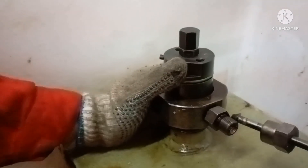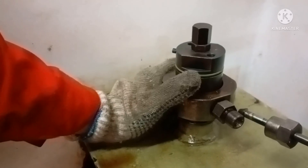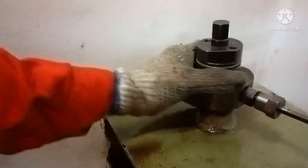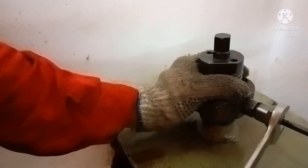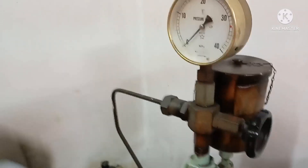The connector should enter the injector space. Now we have to tighten the connector. Once the connector is tightened, fix the high-pressure pipe with the injector connector. I connected the high-pressure pipe and tightened it. As I always say, use proper spanners and the proper size tool — do not use an oversize tool, as it may damage the bolt head.